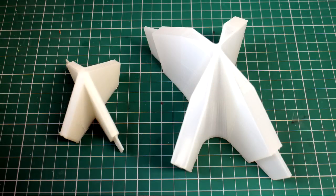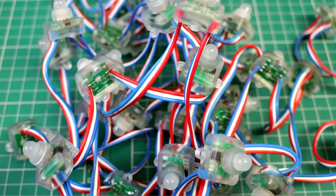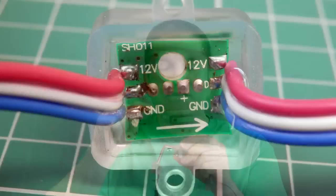We designed this and assembled it all together in CAD just to make sure all the angles were correct. I'm quite familiar with NeoPixels from Adafruit — they're nice and easy to drive, and you can get them in different configurations: rings, strips. From China you can also pick up strips of NeoPixel-style LEDs for very reasonable prices. Each LED has an individual LED driver chip and a shift register, so you send data through in serial form, clock it through, and control the colour R, G, B levels and brightness by PWMing the data.